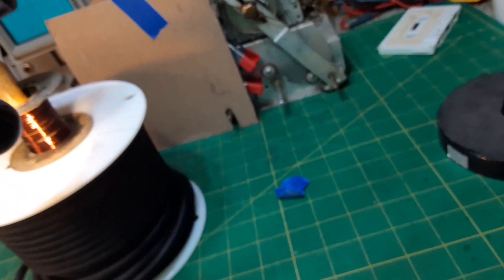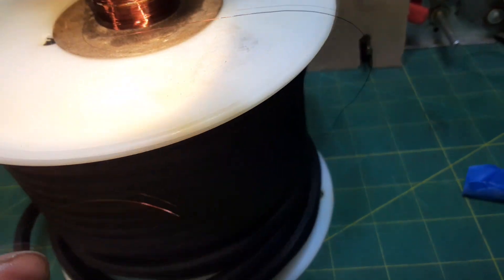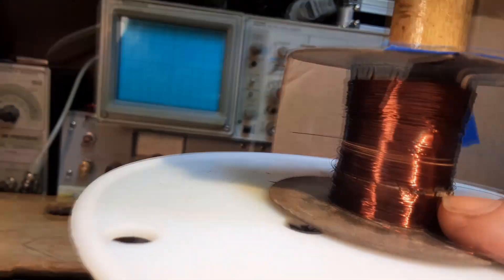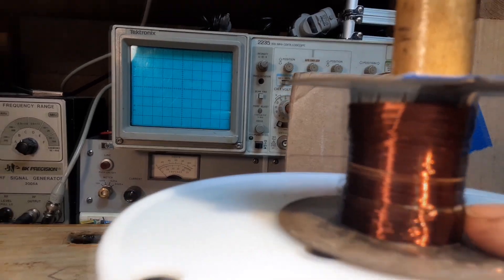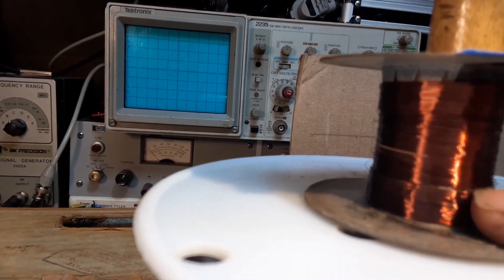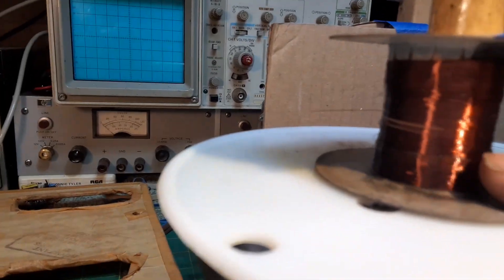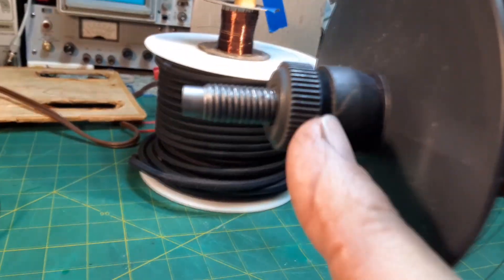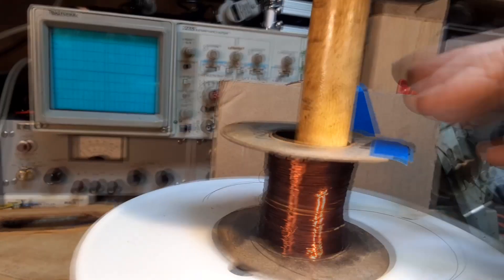I think I finally found a break. Here it is. And there's how much of the spool is left — it's almost empty. It looks like there's some metal in there. I think this was a structural break, not an electrical break — could have been. I'm going to connect it and see. I got the end of the wire right here sticking out of the end of the spool, and I got the other end here too, so I'm going to join the two together and see if that's it.